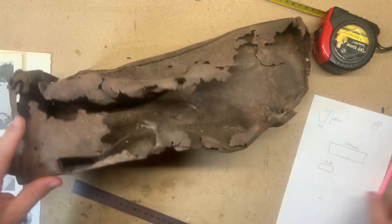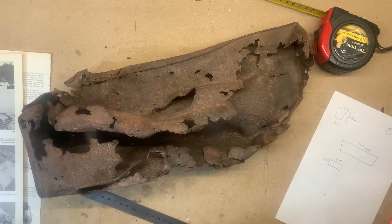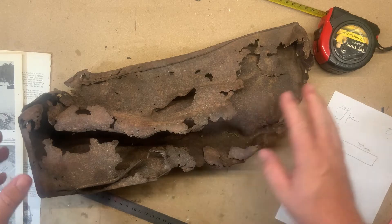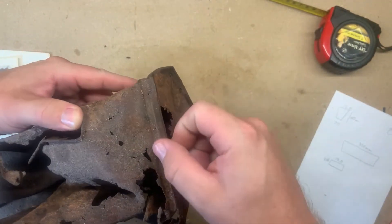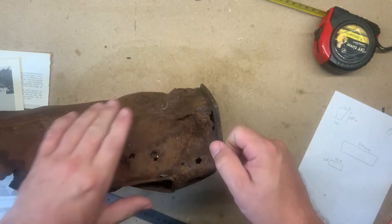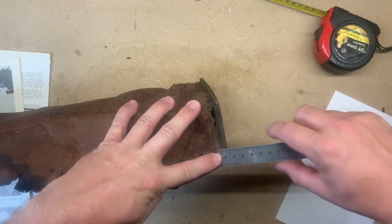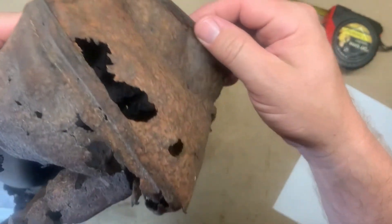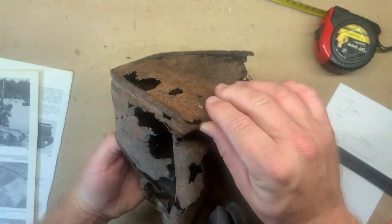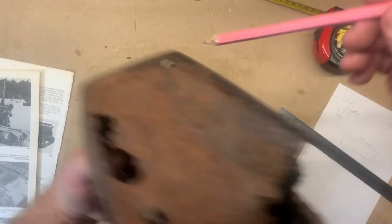I'd say 28. At the end of the video I'm going to show you the 3D model of this that I make. This is kind of interesting here at the end - we have a pressed seam in it, measuring from the end here 12 millimeters in, and the seam is 6 millimeters wide. So this is like a machine-pressed seam to attach this piece into the end.